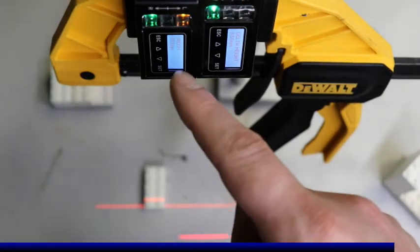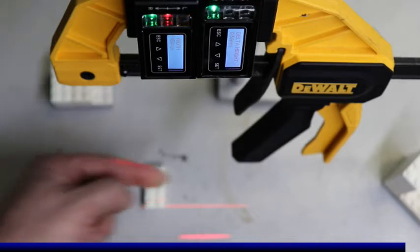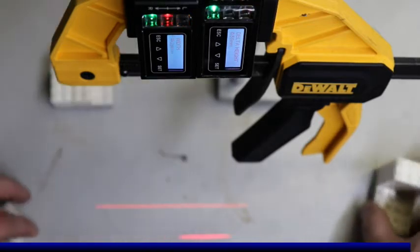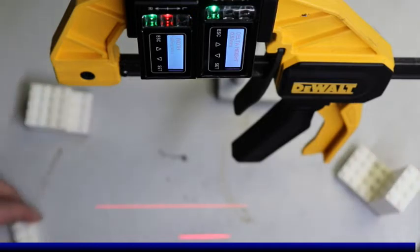So then I can look at the PosCon HM, and this I'm doing overall width. Now we can do far left edge detection, so if you're doing webbing and you want to know how your part's tracking on this side or this side, I can do gap width, so I can know the difference between the two edges here. But in this case I'm just doing overall width.